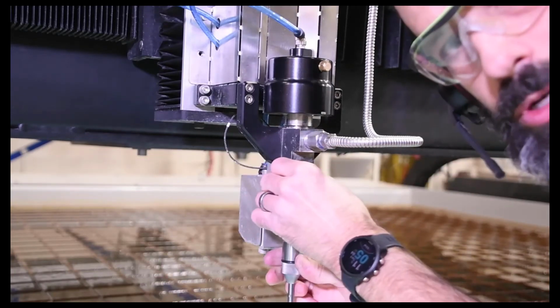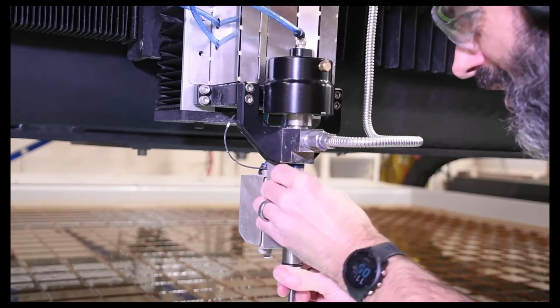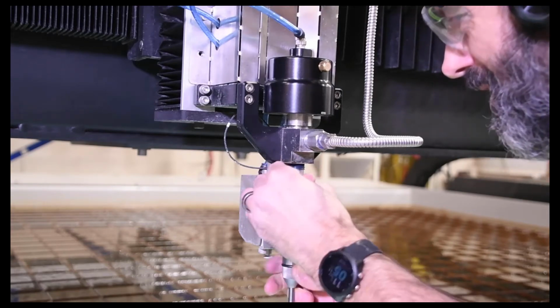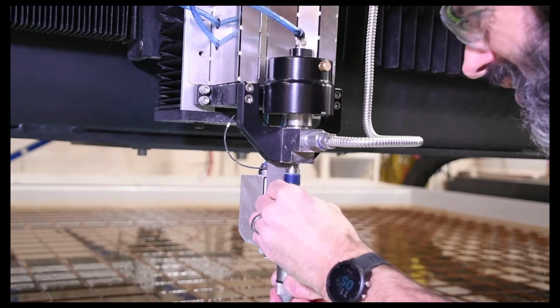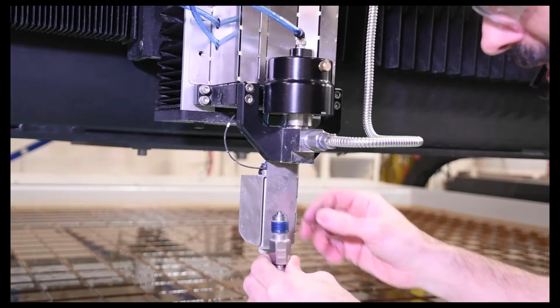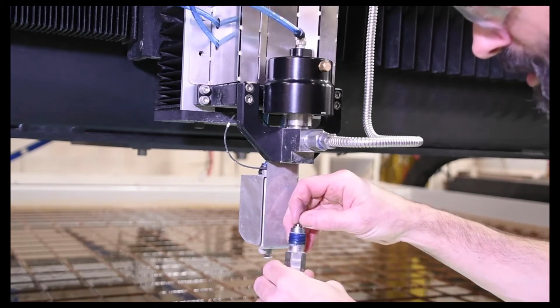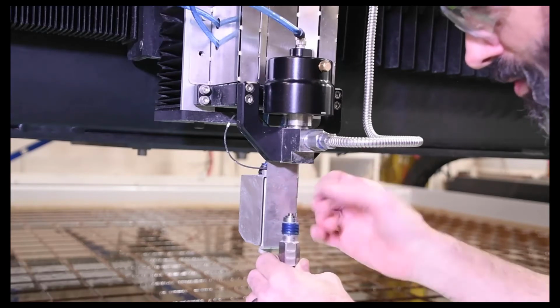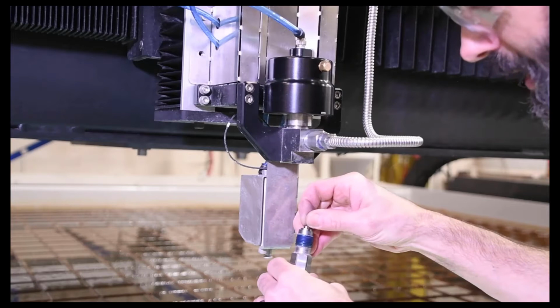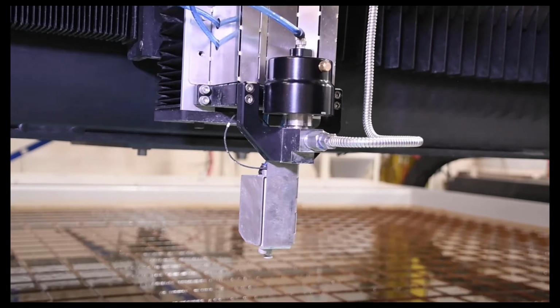Again, I've got my foam underneath here, so hopefully the little seat that's in there doesn't end up in the tank. Again, since this one may already be damaged, not a huge deal, but just want to avoid that if you can. And there's our seat. Sometimes this will get stuck up there. May just have to put a dowel or something up there, free it up, and then we'll take that out once we get it over on the table there.